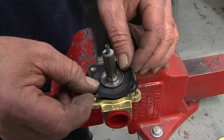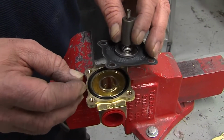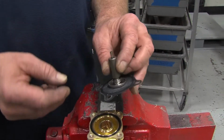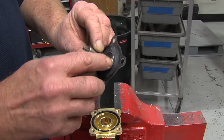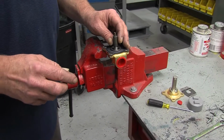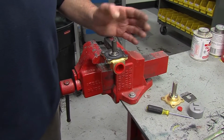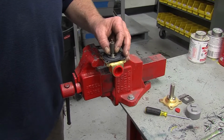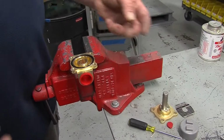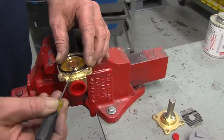Algas-SDI uses a backflow solenoid valve. It allows flow back through the solenoid even when it's de-energized. You'll notice a little bleed hole in the diaphragm. That is usually at about 2 o'clock towards the outlet side of the valve. So you'll remove the old diaphragm, reach in, remove the old O-ring.